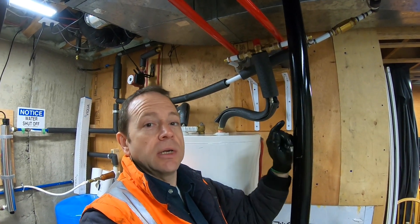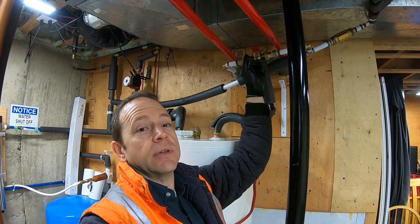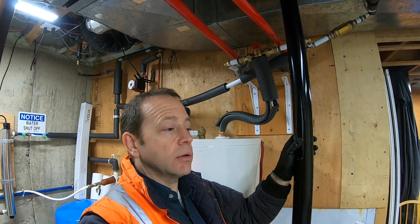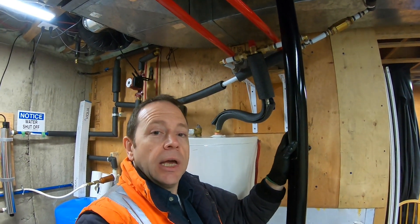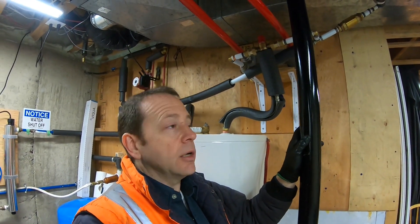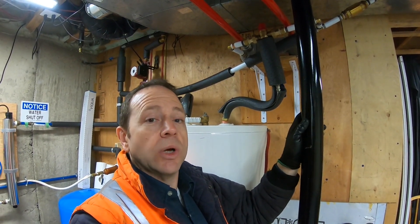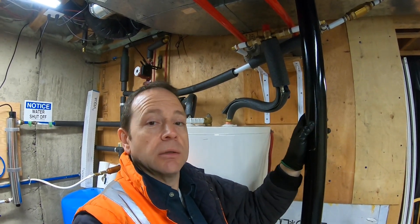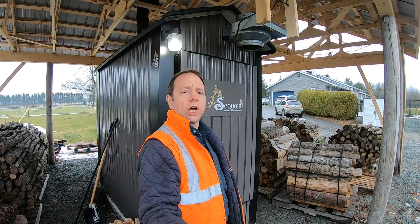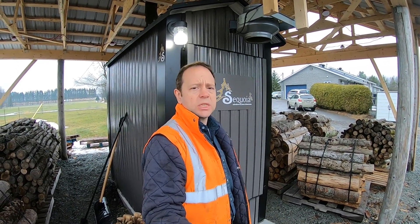The water heater is currently turned off — it's only holding hot water. The circulating pump keeps it moving, but it will add very hot water only if needed, so water never exceeds 140°F. For testing purposes I put that breaker off; I'll switch it back on so that whenever the boiler turns off, it heats electrically as usual. That concludes how this system works with its specificities.